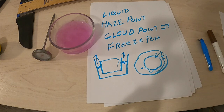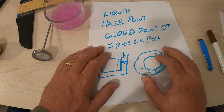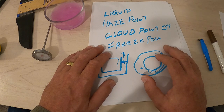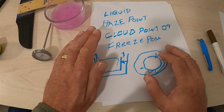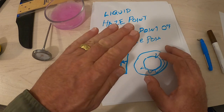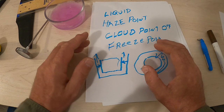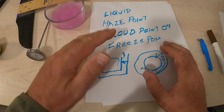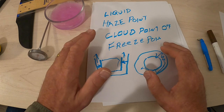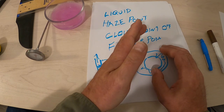So in the last statement here, there are three kinds of antifreeze and different kinds of chemicals. There is ethylene glycol. It's poisonous. Don't put that in your water system. Don't do it. There's propylene glycol. That's the good stuff. Propylene glycol will protect you from freezing just like any good antifreeze will. And then there's this mixture stuff where they take water, propylene glycol, and alcohol.